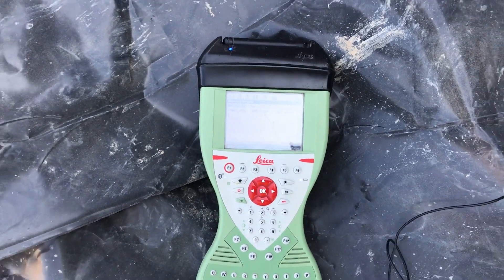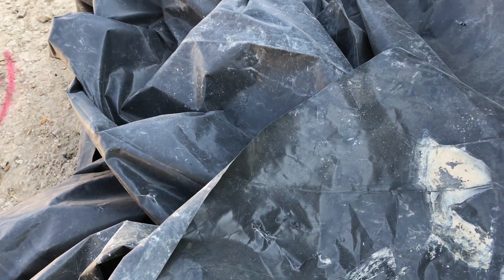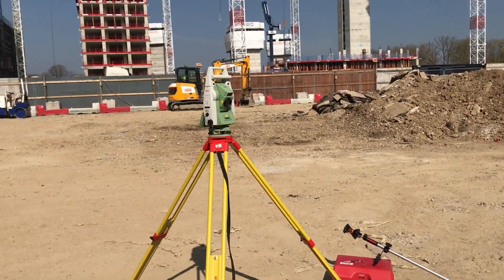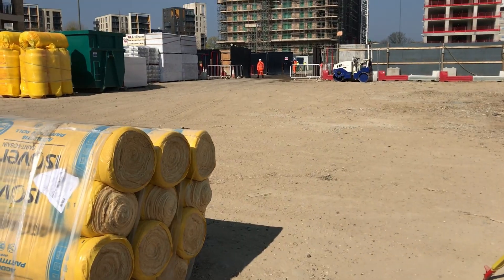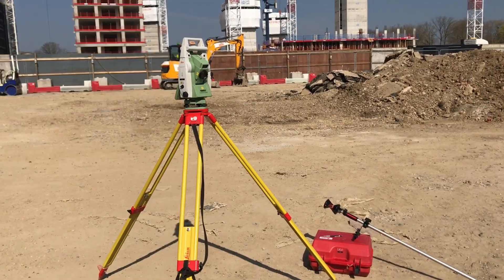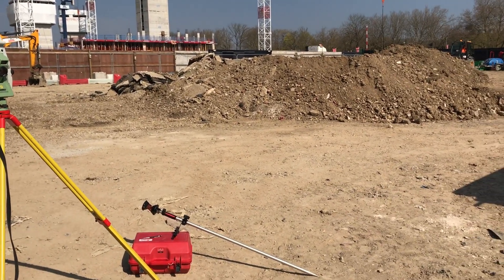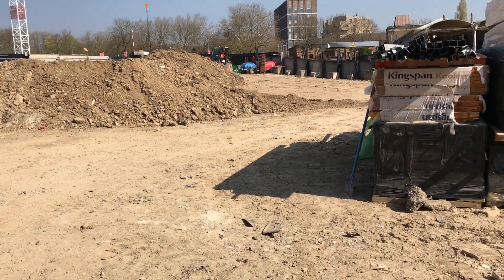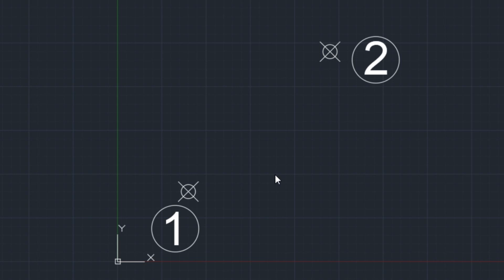I'm going to show you how to create this in the office. What's also very interesting is the reference arc with two points and the radius — because if the site is very big, you might have a capping beam or a building, the line might be very long and the radius very big. So it's very important you have everything under control, knowing which point is first, which is second, and the radius, as this orientates your arc. I'm going to show you this using the TS-06 or the Leica Flexline, which might be the TS-09 as well.